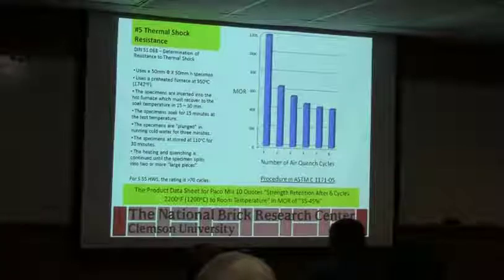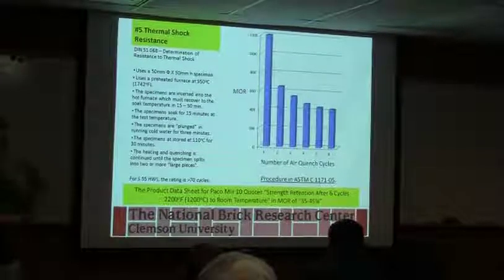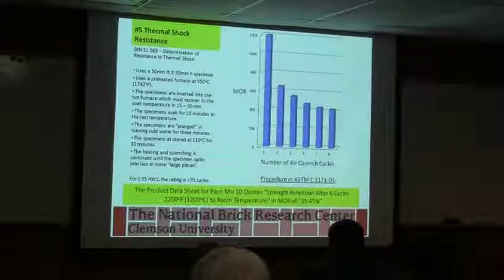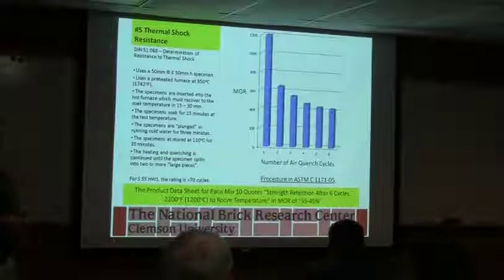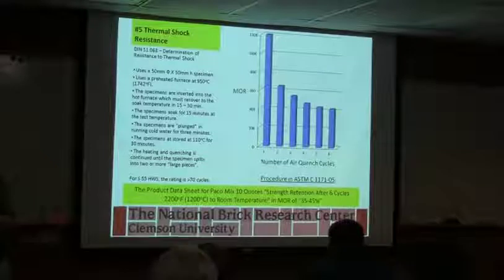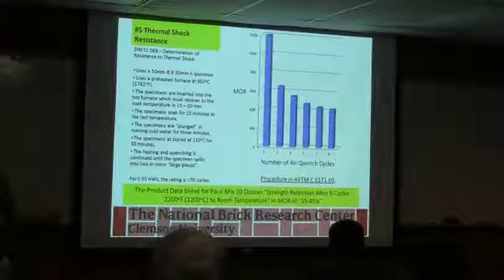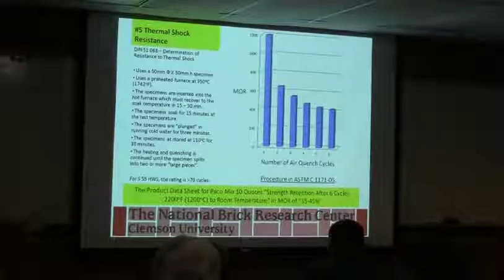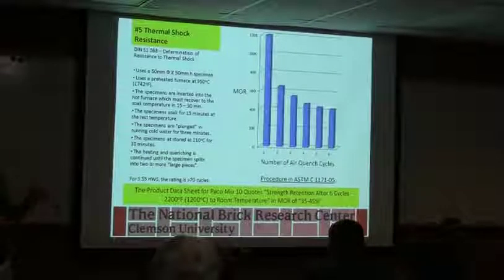Thermal shock resistance also, that's part of the balancing act that these guys are doing when they're making your refractory, is they're trying to make them robust, because your kiln in general stays at a relatively constant temperature. You'll do some shifts depending on the product line, but you're not going all over the place. The kiln cars, however, are going through, and again, yours aren't as aggressive as other product lines for how fast the temperature changes.